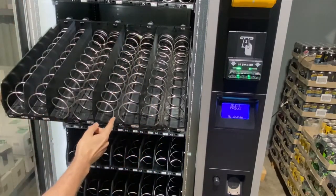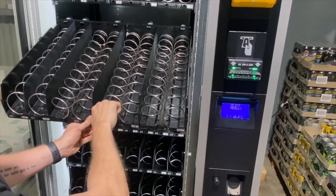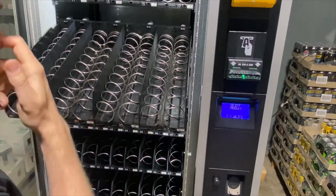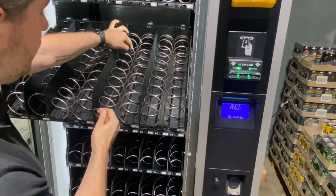Check that the end position of the spirals are in the right place. If they're not, they can simply be adjusted by pulling towards you and then twisting clockwise or anti-clockwise to your desired position, releasing the spiral when you have it in position. Do not force the spiral around — make sure you pull the spiral towards you and twist.